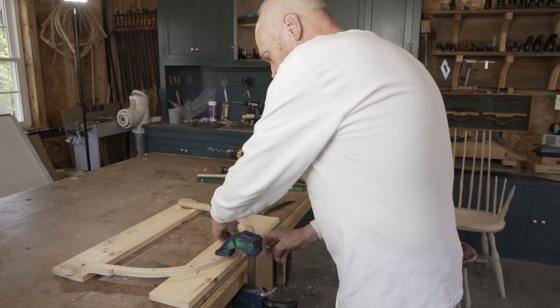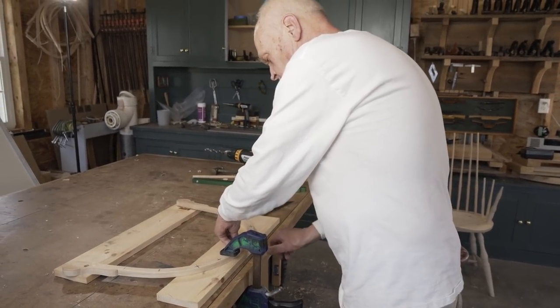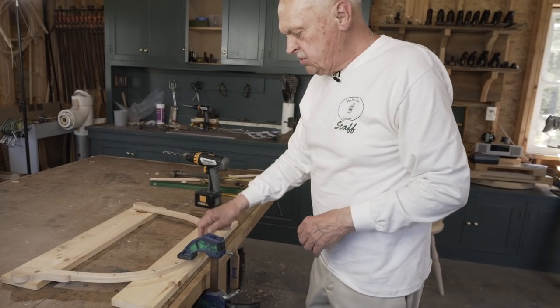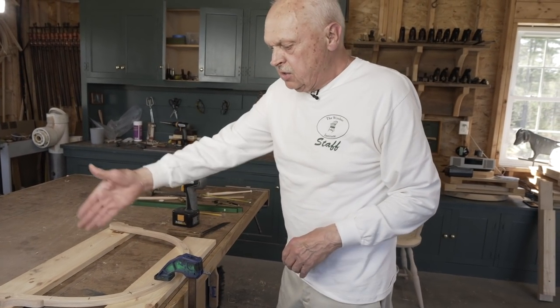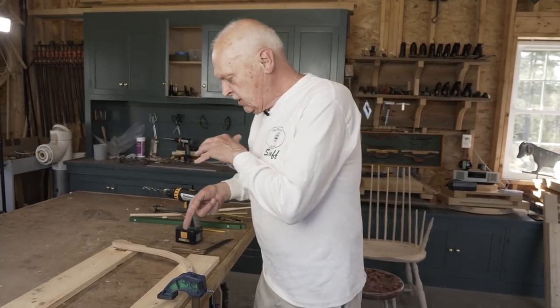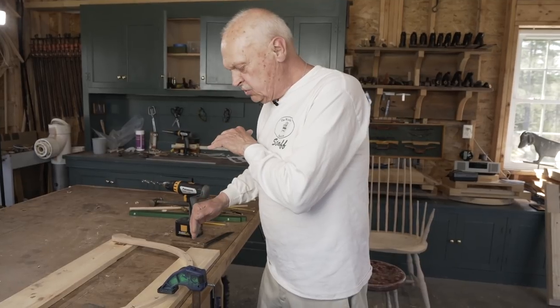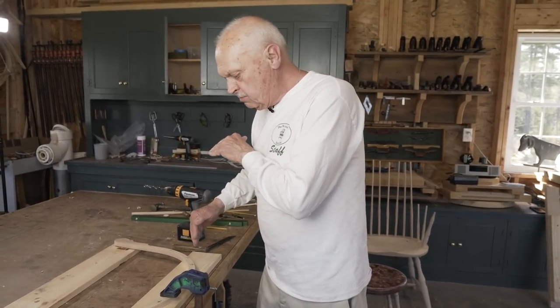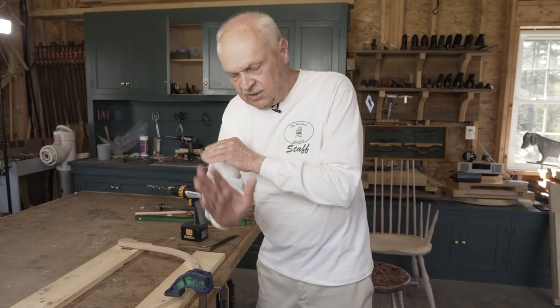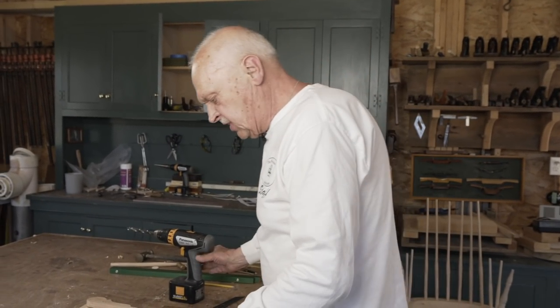This is the cheapest insurance policy you'll ever buy — it's just a clamp. The reason I put it on there is we used oak because it splits so nicely and evenly and cleanly. It retains that property. If I drill a series of holes and then wobble my bit, it's possible to make the arm rail split and ruin your whole day. The clamp prevents the wood from spreading and prevents that catastrophe.